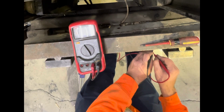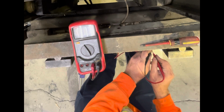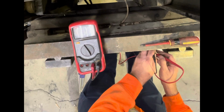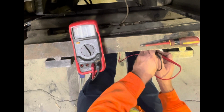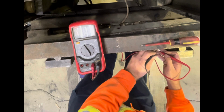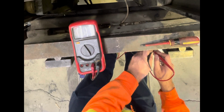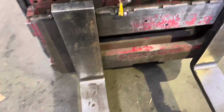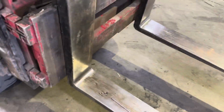There were no anomalies in the readings. And I tested it repeatedly, so each reading came back the same. Each load cell matched each other for resistance, for the weight bridge and everything like that. So going forward, I said, okay, junction box is good, load cells are good. I'm checking all the connectors now, to see if there's any damage, cuts, rips, tears, any parts where some rodents may have chewed anything. I don't see any of that stuff.